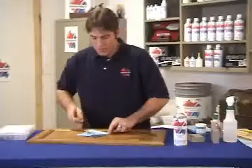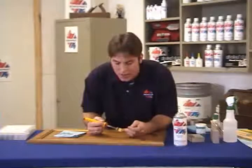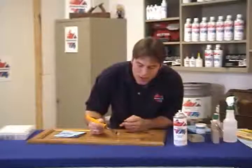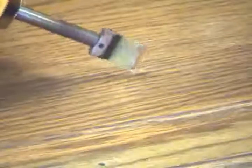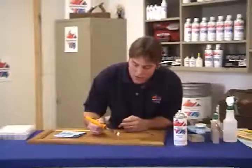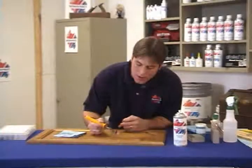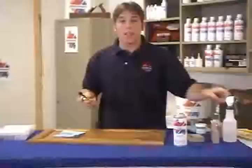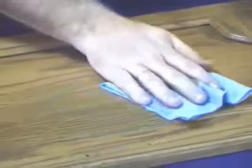Let's do a burn-in. Position the knife above the void and melt just a little bit of the stick onto the knife. Drop the fill into the void and slowly work it to the sides and to the edges of the void. When working on the sides and the edges, you can guarantee that your void will be filled and will look proper. There, that looks filled. Now let's cool the burn-in with a little water. Clean the knife. And remove the water off of the burn-in.